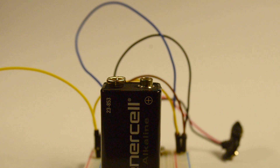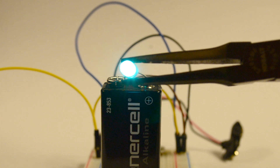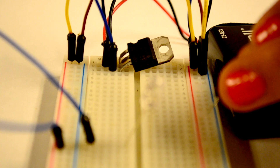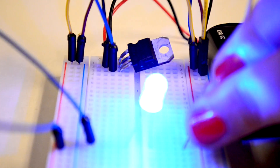For example, when we give this LED 9 volts of battery power, it burns out almost instantly. But add a 5 volt regulator and the LED now lights up nice and bright without overloading.